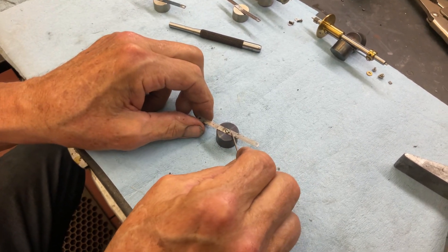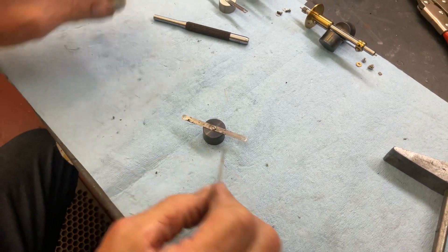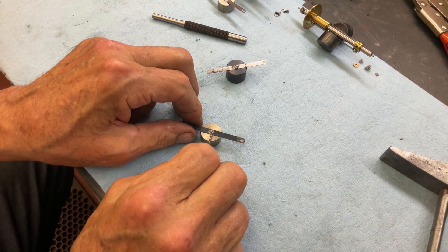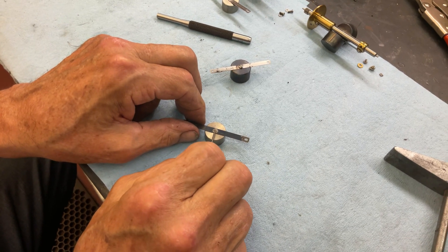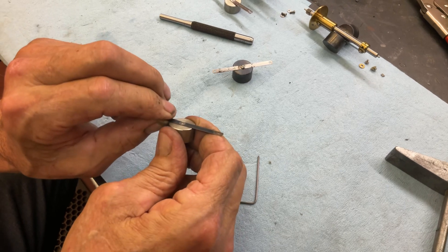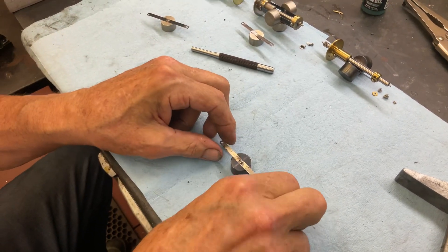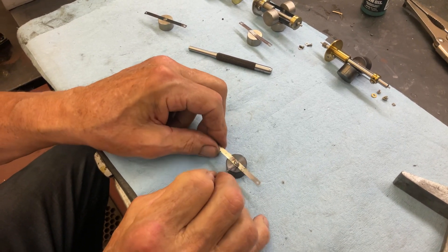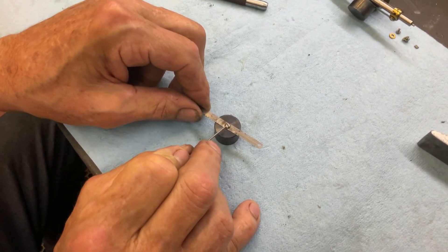You can see right here I have a little bit of grinding. What I did was I came in with my Dremel tool and ground this off gently. I'm grinding the bubble right here, not this flat piece that looks like a washer. I'll grind that out until I can pop it off. Then I chucked it into the lathe, drilled a hole, and added this stainless steel button head screw right here.